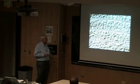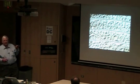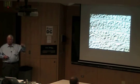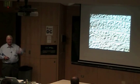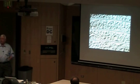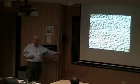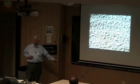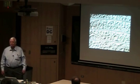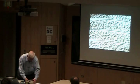An interesting technical aspect to this is that if you reflect light from a half-wave irregular surface like that, you get a full wave of irregularity, because reflected off the peaks and the valleys is the whole wave of difference, right? Now suppose it were transparent, and suppose it weren't reflected, but just a transparent piece of plastic exactly like that with an index of about 1.5. The light going through gets only a quarter wave irregularity, right? And you know about Rayleigh, you know that in a quarter wave, it's not even diffuse. So we're working right at the cusp where physical optics and geometric optics come together.